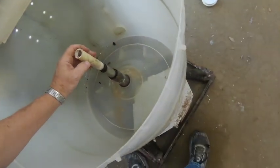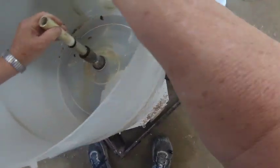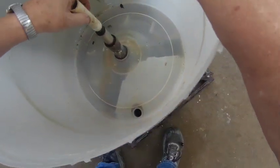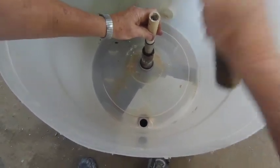In the past I've used PVC pipe of the appropriate sizes and I've tapered the ends using a wire brush on a bench grinder. But that hasn't worked out very well because when you pound it with a hammer enough times the PVC will crack, and sometimes it just doesn't work that well. So I got my calipers out and got the right sizes for the inside and outside diameters of the seals that I need to seat and the areas I need to seat them in.